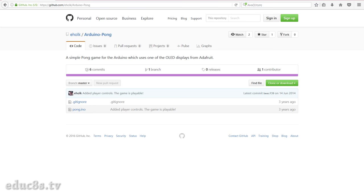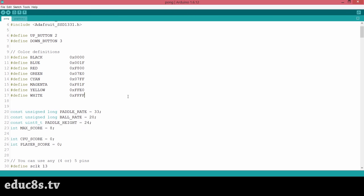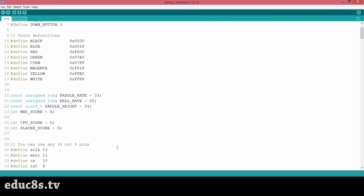Let's now take a quick look at the code. The code of the project is based on the code of a Pong game for the monochrome OLED display. You can find the link for the original code in the description of the video below. I modified the code to work with the color OLED display. I added the splash screen, the score and the game over screen. The project needs two libraries in order to compile. We need the Adafruit GFX library and the library for the OLED display.